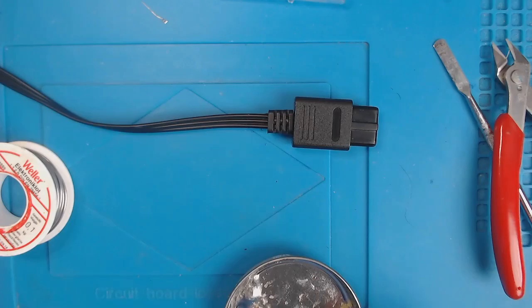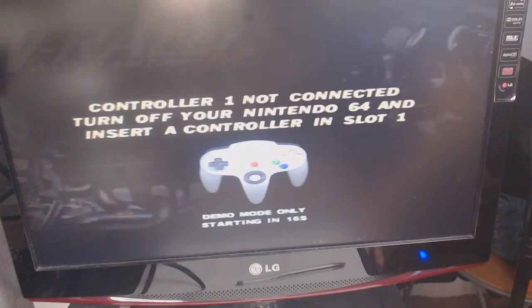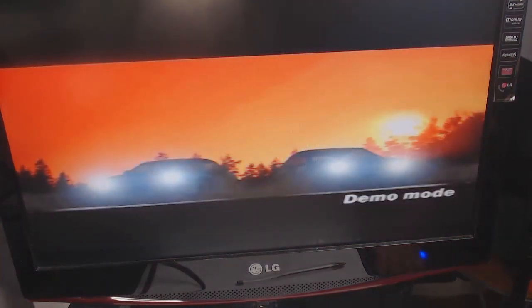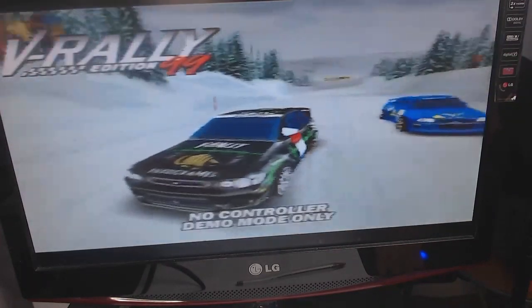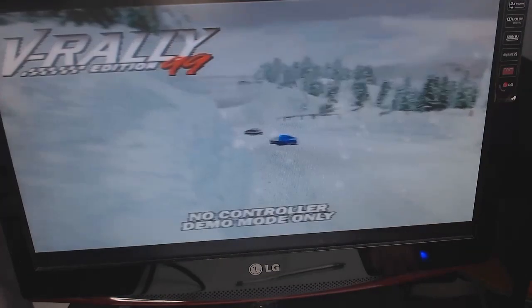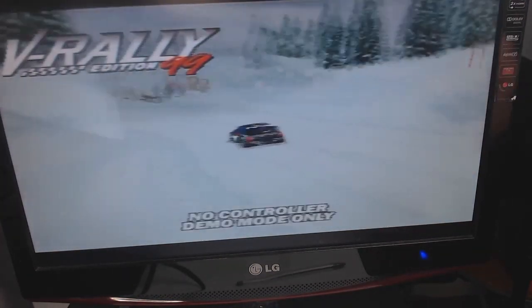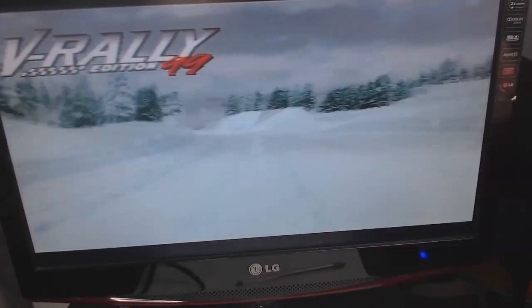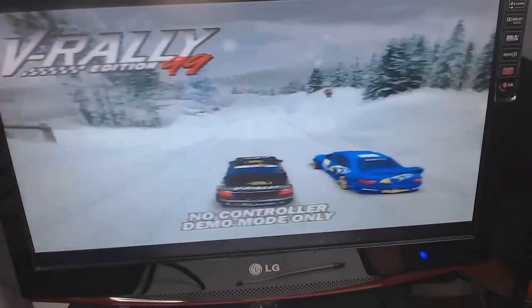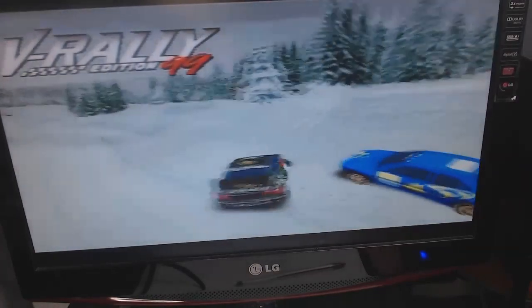Perfect, let's try that. There's the TV, and already it's looking a little bit easier to read this writing. I'll just wait for the title screen — that's much better. You might not be able to tell through the video, but all of the snow — there was no detail in any of this snow previously, and I can't remember seeing the shadows up at the top here as well. That's worked out great. So that's the 75 ohm resistor on the video to ground, and that's for using it on PAL TVs.